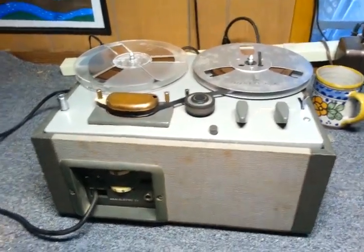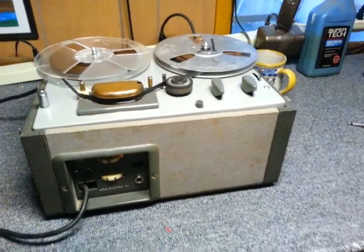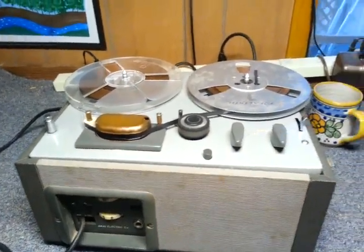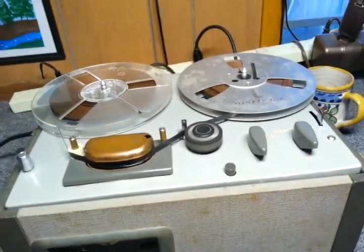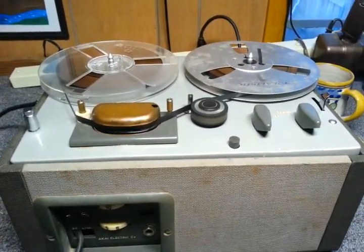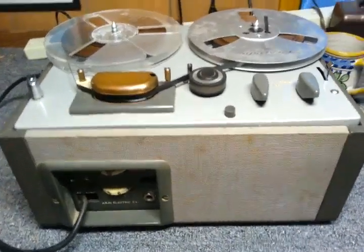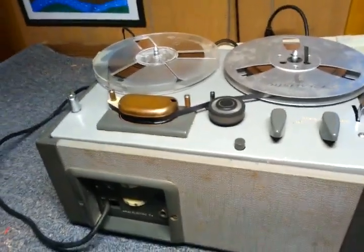But whenever I had it apart, and I would power the machine up, I had the right value, and I also replaced the filter electrolytics while I was at it. And I actually ended up putting some of those photo flash 160 and 120 microfarad capacitors in, that came out of disposable cameras, because I didn't have much other high voltage. I had, like, 3 10 microfarad 450 volt electrolytics on me, and a 4.7 microfarad 200 volt electrolytic on me. Those are basically my only high voltage electrolytics, aside from the photo flash ones from disposable cameras. The original filters had a couple of 60 microfarad capacitors, and then I had a 40 microfarad.